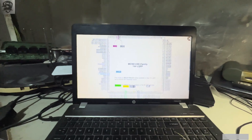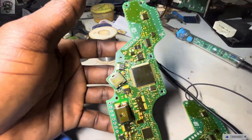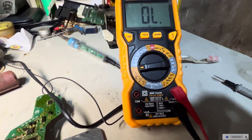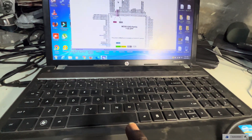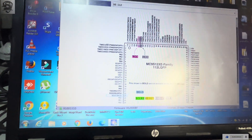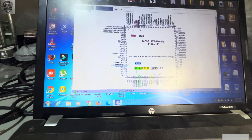I use my multimeter to check and test every point. I've done the same on this one too so the work won't take long. Now, the chip is not 144 pins — it's 112. To know your pin count, count from one side: it gives 28 pins. Multiply 28 by 4 and you get 112. Then we go back to read the entire data.